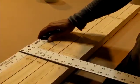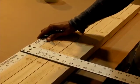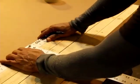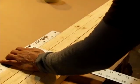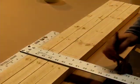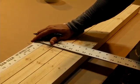What you do is you come over, since you know your 2x4 is exactly 1.5 inches wide that we're using, you want to come over from that center point just a hair more than 3/4. Make sure they're all nice and straight. And you want to mark it. Come over here. We're going to go just a touch more than 3/4.